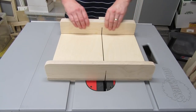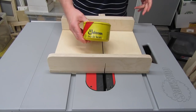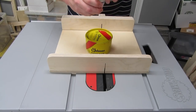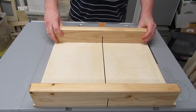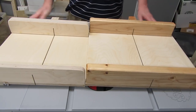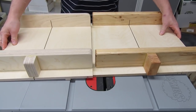When everything's done, feel free to do whatever type of finishing you want. You can sand the bottom of the base, but I usually don't sand the top because I don't want my stock to slide around too easily. You can wax the bottom to make it slide nice and smooth. I recently bought a product called Slide Ease from Amazon for less than $10 — it has the same kind of texture as wax but smells nice and seems to work just like wax. I spray lacquered my 2x4 fences and lightly spray lacquered the top of the sled base. Both the sled with 2x4 fences and the sled with plywood fences look good and work equally well, so it's really up to you to decide which kind you prefer.